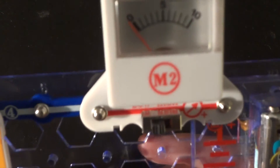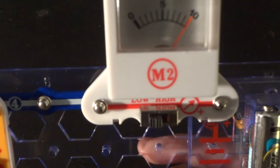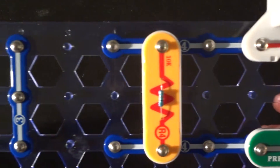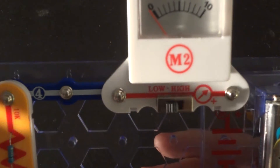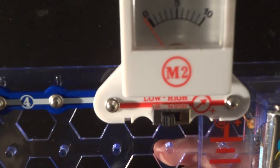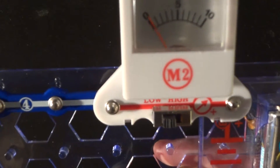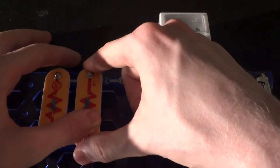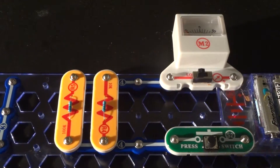To prove that, we activate the circuit again — we get 10 milliamps. Now I'm going to unclip the 100,000 ohm resistor. The needle only went down just a little bit, showing most of the current is going through the 10,000 ohm resistor. Now if I put the 100,000 ohm back and take off the 10,000 ohm and apply current, it's only a little bit of current — not even one milliamp. This shows that current will always flow through whatever load provides the least resistance. That's basically how series and parallel circuits work with resistors.